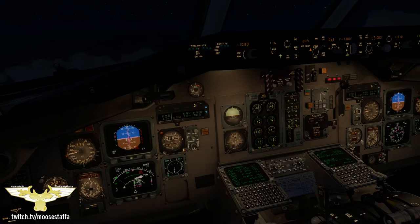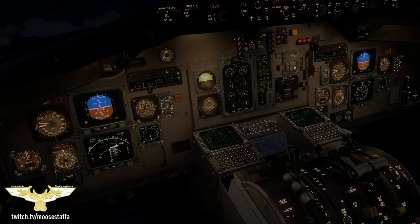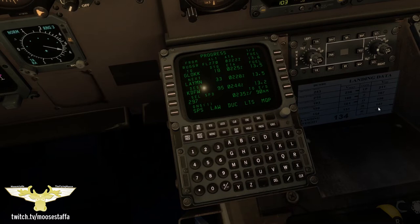Landing data is not quite yet confirmed. We could do that now. It's maybe a little early. I usually don't like to do this until we're about 15,000 feet or so, but we'll go ahead and do it for the sake of it. If you click down here, it'll switch this placard to the landing data placard, and you'll see our landing weight there, and you'll see our VREF speeds, basically,